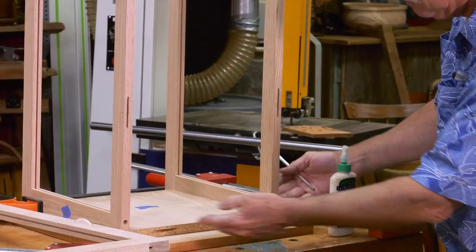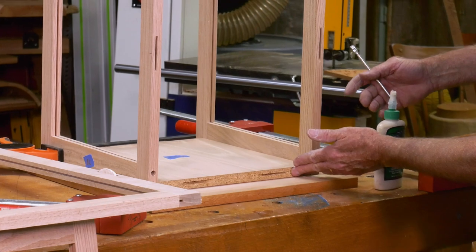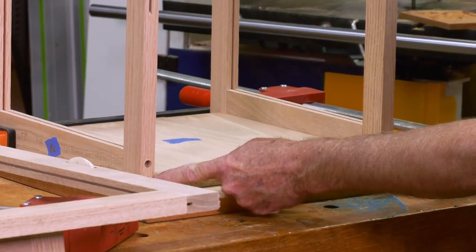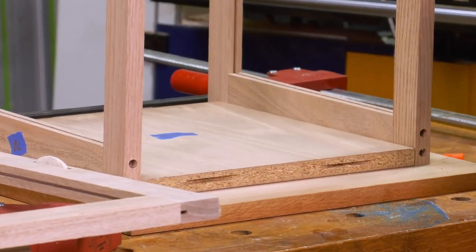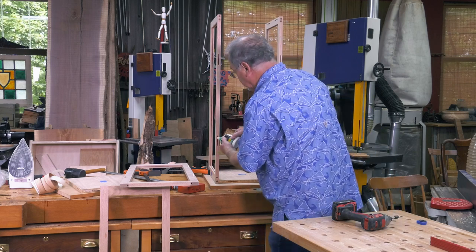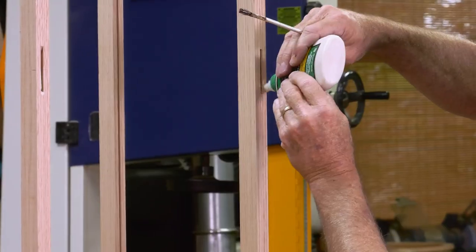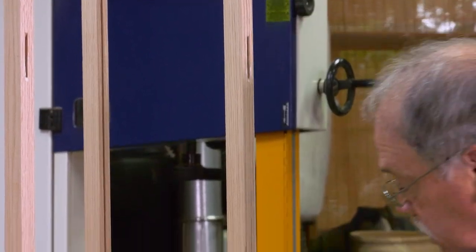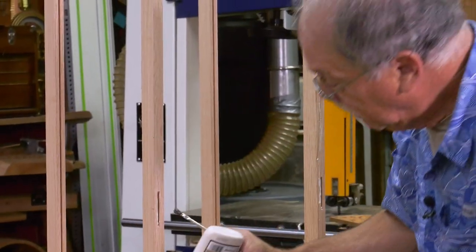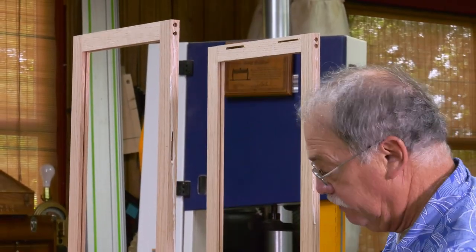So look at this. Left and right of this bottom piece, 13 and an eighth by 13 and 5/8, is MDF again, veneer, good faces up, it's marked bottom. And these pockets right here, they really aren't an ellipse, they're just part of a circle, that 4-inch cutter in that biscuit joiner. Get glue in the middle of this, and then glue gets brushed out along both of these edges to have just the right amount of glue without having a bunch of squeeze out that would contaminate the finish.